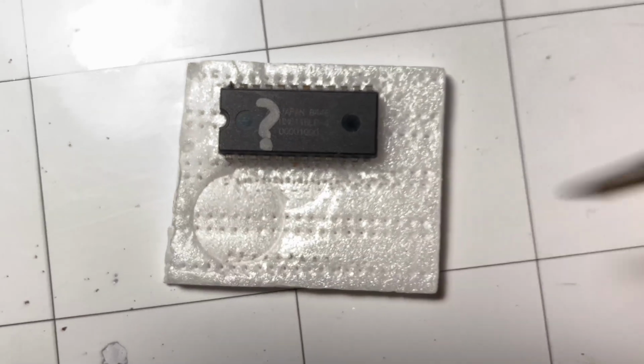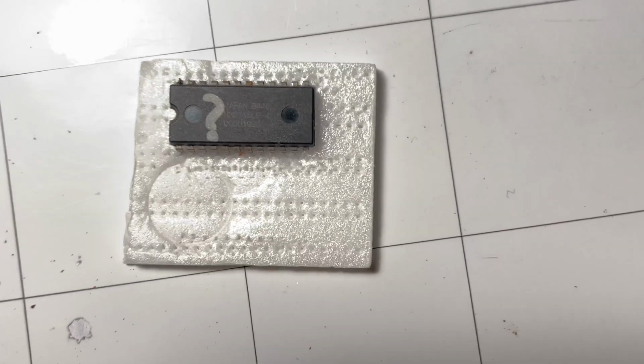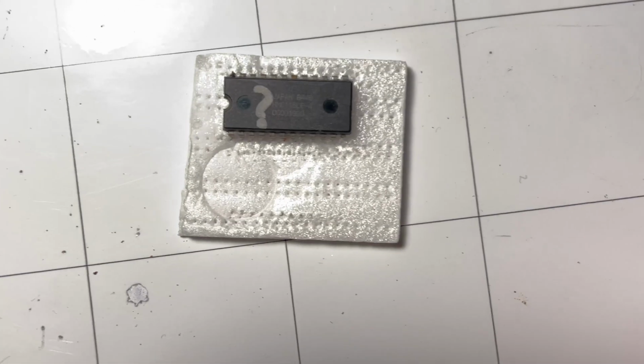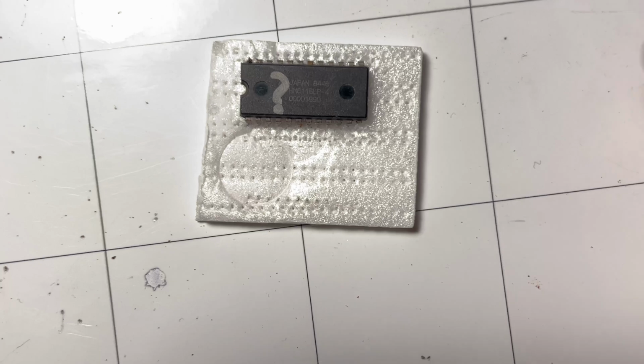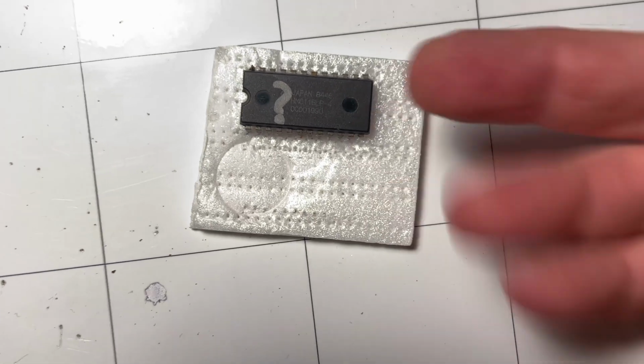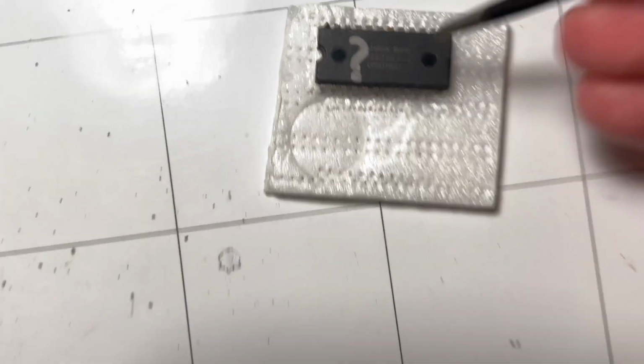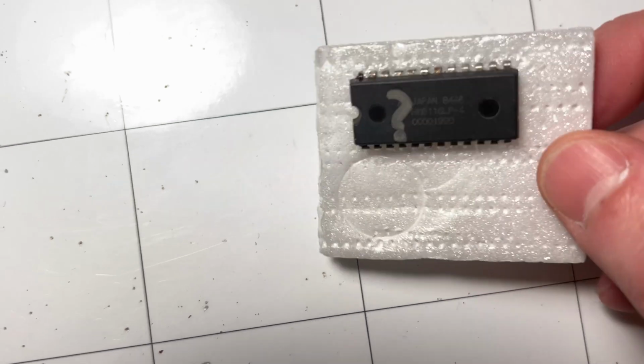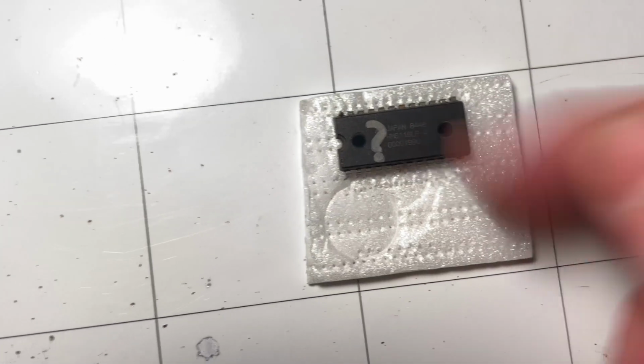And so when the keyboard turns on, the CPU is, I'm assuming, grabbing all the firmware data from the firmware integrated circuit, and has to deposit it somewhere. And as I said, because this guy was directly in the splash area, I have to think that maybe something is really screwy with this guy.